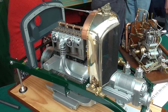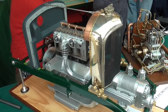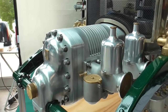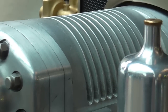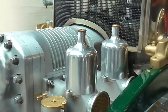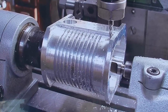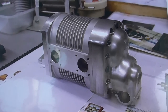I'm now looking at a third-scale Bentley engine, and I consider this the nicest work in the exhibition, so let's take a few close-ups. Looking at the front, this is the supercharger, and this has been machined from solid. I'll show you some pictures in a moment of the setups used to machine these features. Have a look at these grooves — they've been machined using a dividing head and a tailstock. These covers have been machined using a form tool, all done on a hardinge lathe and an Aciera milling machine. Here are some of the setups in the milling machine, using the dividing head and ball-nose cutters to cut all kinds of complicated profiles. This is cutting the casing for the supercharger, and there is the finished supercharger, machined from solid.